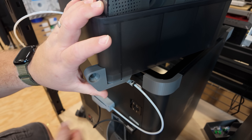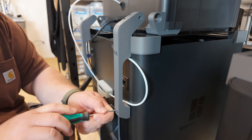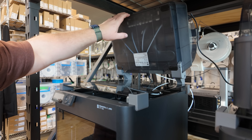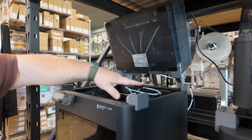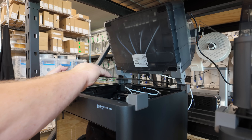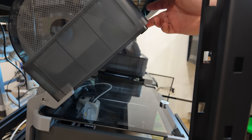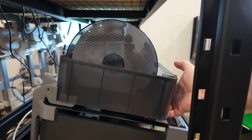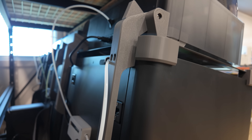The next mod I recently found and really fell in love with is known as the AMS flipper. This allows you to physically connect your AMS unit to your P1S and on demand flip it up and back to have access to the top of the machine. It's super handy — not only in my farm loop automation configuration, but just in general, being able to tilt the AMS back, pull the glass off, do whatever you need inside, and put it all back together without disconnecting wires, PTFE tubes, or needing extra space. Worth its weight in gold — it prints super easy, is very strong and robust.